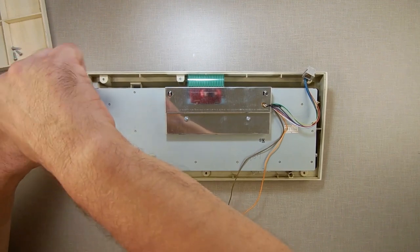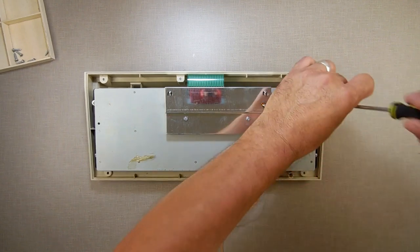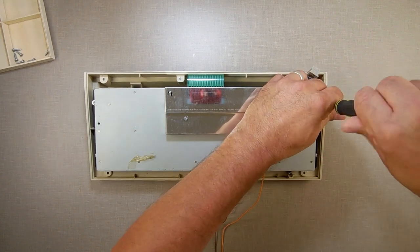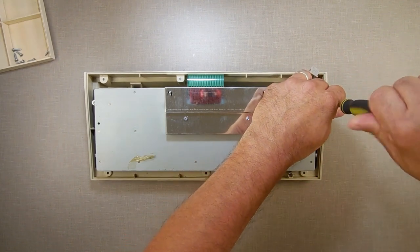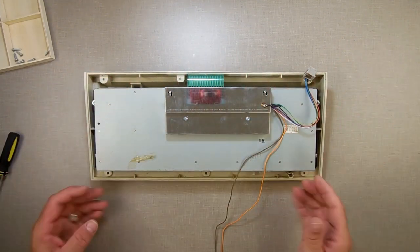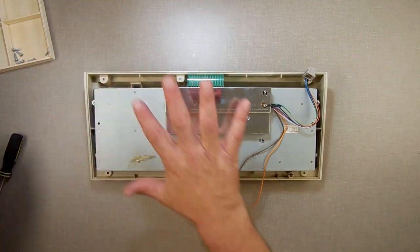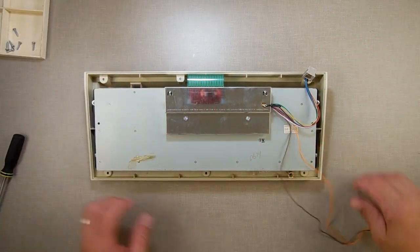and mount this here. Now you may ask, well, why are you going through all of this, Millie? Why don't you just take the thing apart? Because I don't want any pressure on the keys. Because as soon as I get this thing apart, if I have to dig in here and pull the back off and get the membrane out, as soon as there's no pressure on the keys, they're popping the little rubber domes everywhere, and I don't want the rubber domes going flying. So this is what I do to hold it in place.